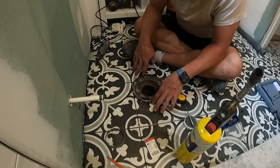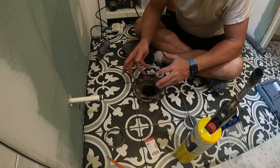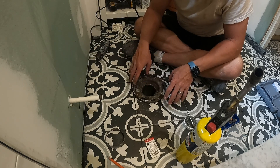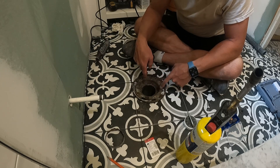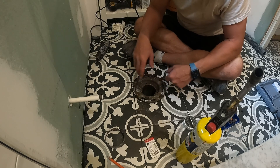The bolt setup looks really good - I just measured it out, it looks great. Now I'm going to solder it up. Same thing - we've got to build heat into it and work our way around this copper. You just can't heat up the whole thing at once; it doesn't work that way. This is actually a little cleaner than what the old copper looked like. So let's start heating it up.